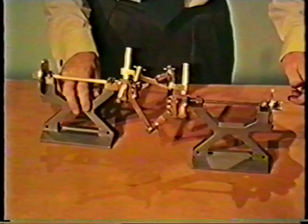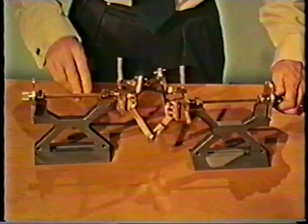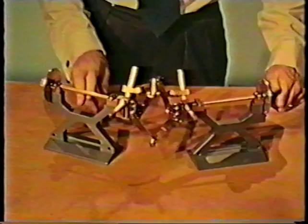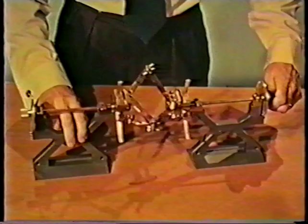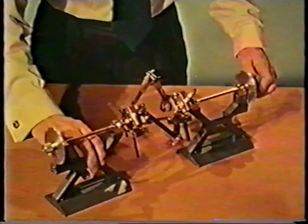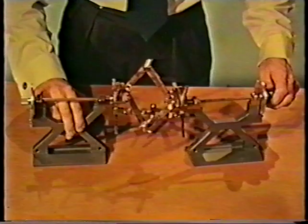This is perhaps rather unexpected. The coupling constrains the shafts to remain angled to one another, and then, if they are moved through the in-line position and out again, it constrains them to remain parallel to one another. The shafts cannot go directly from an angled position to a parallel position — they have to go through this configuration of uncertain constraint, when they're in line, in order to get from the angled to the parallel configuration.